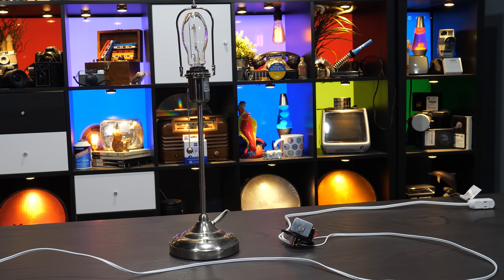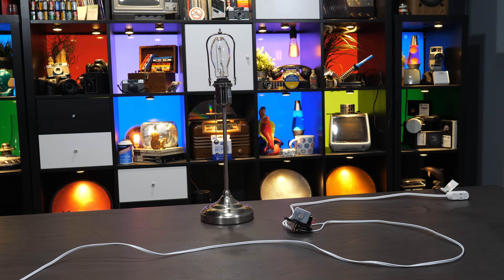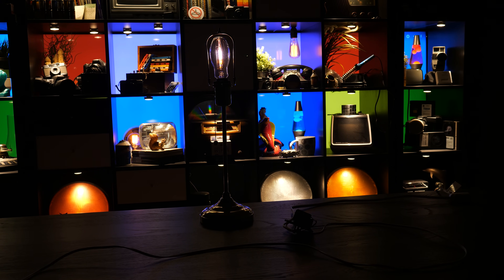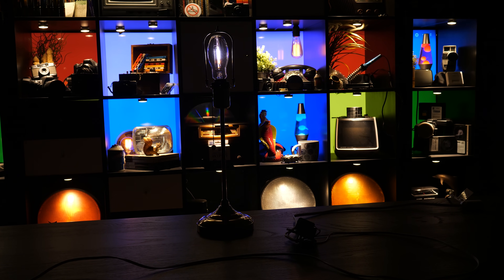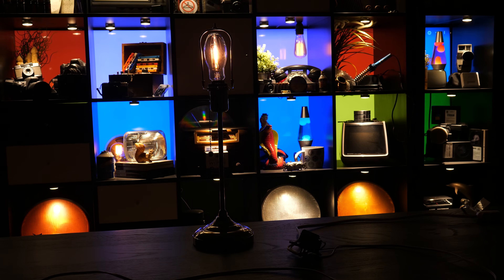I've wired up this streetlight in a demonstration of the photo control in action. Right now the sun is up, so the photoresistor is letting enough current through to keep the heater powered and the thermostatic switch nice and toasty. As we approach sundown, the heater slowly loses power as the photoresistor's resistance increases, and its heat output falls. In this simulated sunset, the heater instantly shuts off, but it takes a while for the thermostatic switch to cool down. Once it does, the switch closes and the light turns on. The delay is actually quite useful, especially for lighting technologies like the high-pressure sodium lamp shown here — ideally you want to minimize the number of times these lamps start up, and the varying lighting conditions at dawn and dusk could result in some wild behavior.